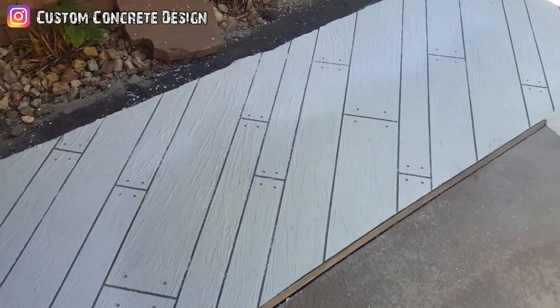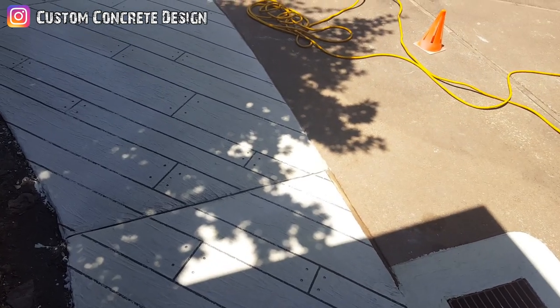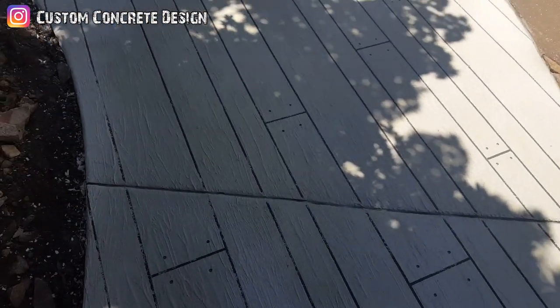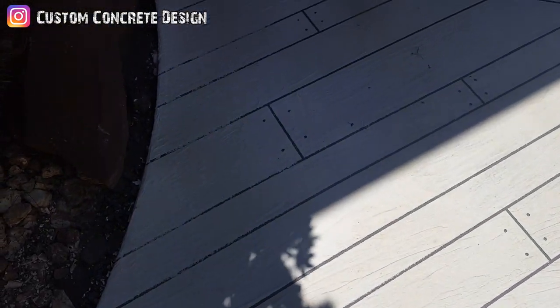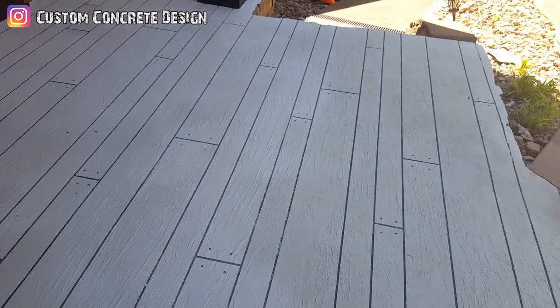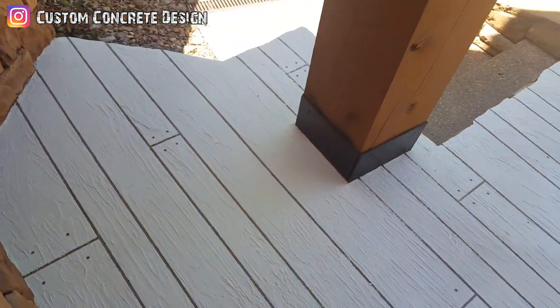It's cleaned up and ready for some color. All the tape's been pulled, it's been cleaned up, joint lines are open, it's been edged up against the driveway, everything's nice and clean. All the nail holes have been drilled — every plank has two nail holes on each side, four per line where the planks meet, and they are staggered and uneven on purpose. We want this to look as authentic as possible — perfect imperfection. I'm going to hit those nail holes with some darker color to make them completely black, then we'll start the coloring — brown and amber.